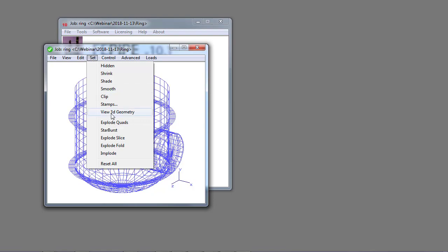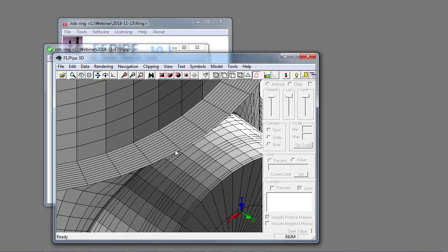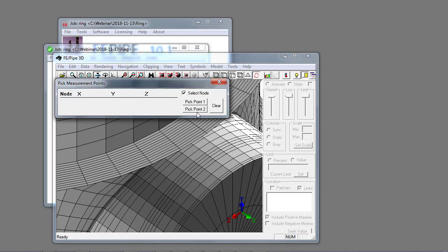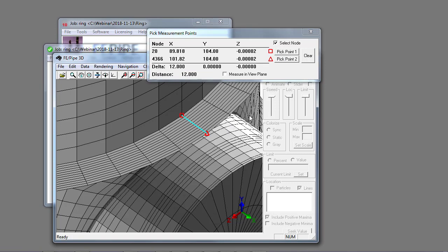I'll prepare for analysis and view the 3D geometry to measure the width of that plate. I want to dimension the underlying nozzle to get good alignment between the elements on the nozzle and the plates above and below. I pick the corner node at the penetration edge between the cylindrical surface and the ring, and then the node on the outside radius of the annular ring — it's a 12-inch ring. So I specify the reinforced nozzle length to be 12 inches so the first set of axial elements on the nozzle are aligned underneath the annular plate.